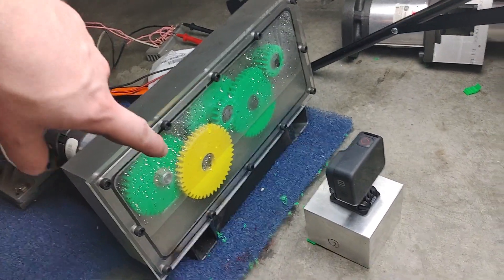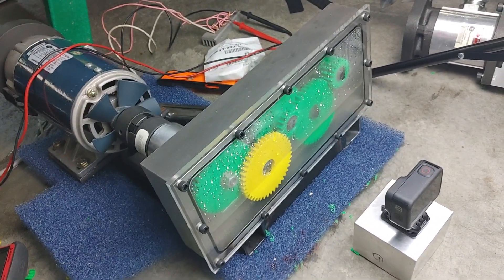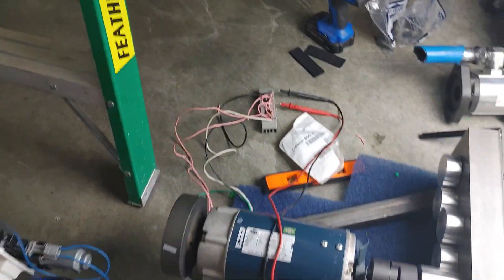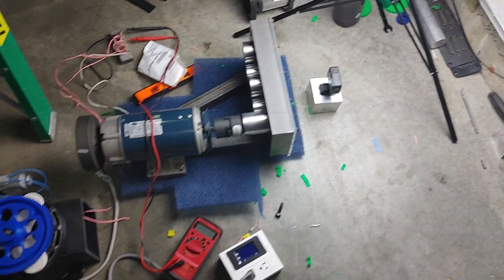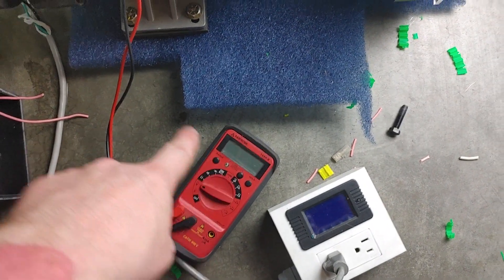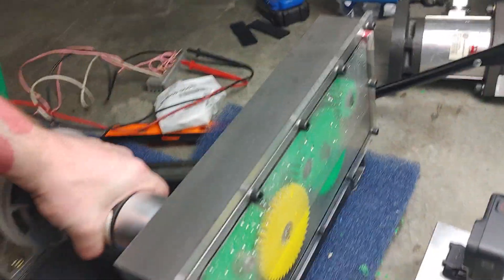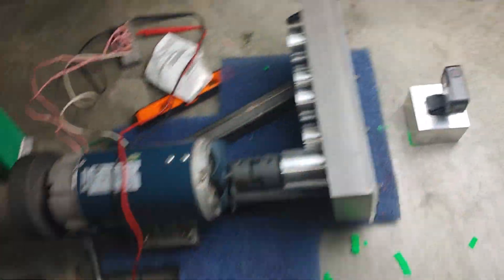So ultimately I'm just going to reduce the width of the gears, reduce the contact area. We're testing between gears, not how big the gears can go. I want to make sure that whatever oil I use, the setup's not going to be overloaded. I'm just going to bypass these rectifiers anyway and run this test again to see what speed we can get. This voltmeter represents the input RPM — 90 volts on here will be 5200 RPM, and then that's multiplied nearly 30 times. The gears look really good still but they take quite a lot of torque to spin, and that's just because I've got a lot of water in there.